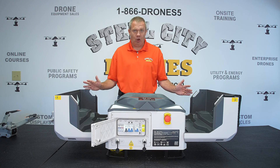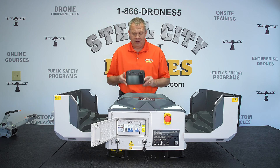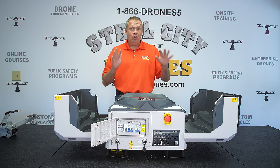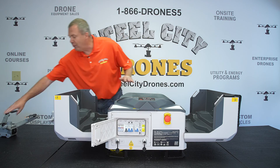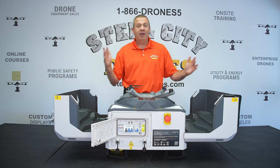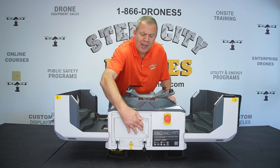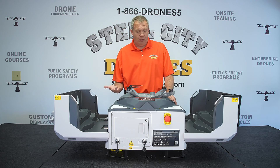As you can see, we have the Dock open. What we did here to get to this point was we used our RC Pro remote and hooked it up via USB to the front panel right here to activate the Dock, activate the aircraft, and do a release of the Dock opening cover through the Pilot 2 app. We have our aircraft right here, which goes in just like that. Now we're all set to configure everything and do all the firmware updates. We also have to make our manual Ethernet and AC power cable connections as well, so we have a little bit of work to do.